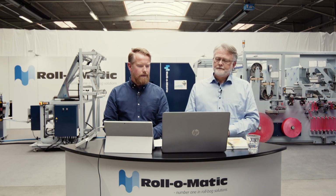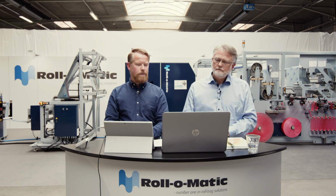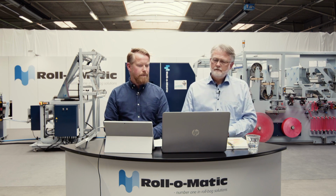Yep. Next question here, what do you mean by double sealing of the draw tape? It is a double sealing, so we actually have two different sealing systems, sealing the hem area where we have the tape and the hem itself. And the second sealing system is actually offset, so it seals a little bit into the two layers of film. So we prevent the hole you see in some bags right between the 4 layers and the 2 layers of film. Okay.